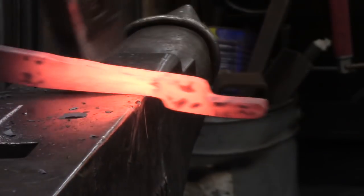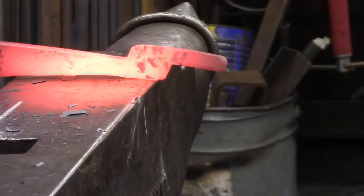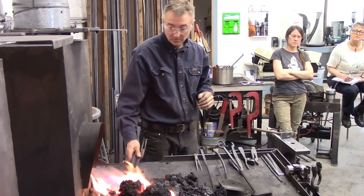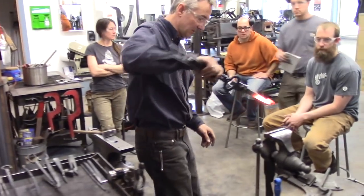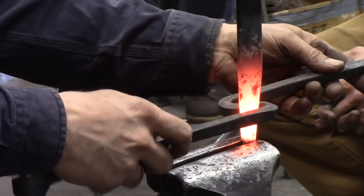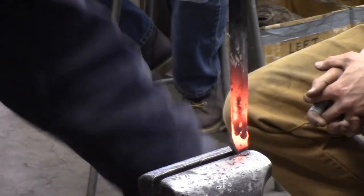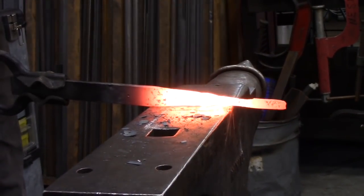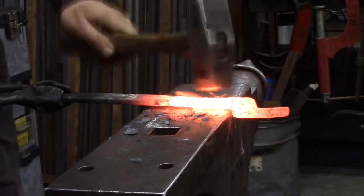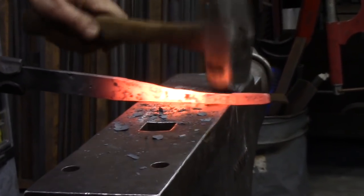When this area starts to look like a square section, stop. Don't spread the twist over a long area. We're just going to grab a little ways away from the shoulder — right about there. Corner turn. So take our twist away, work that, work that, and kiss the corners — and that's all done.